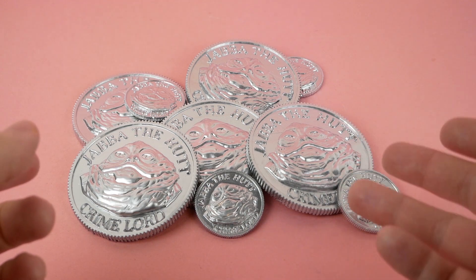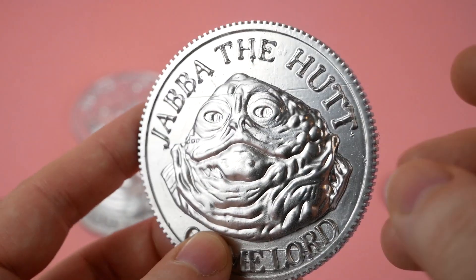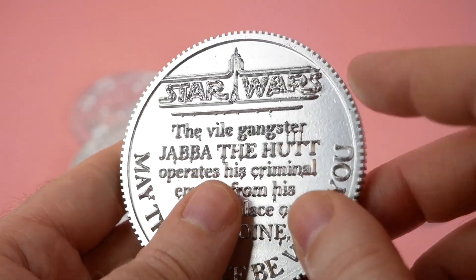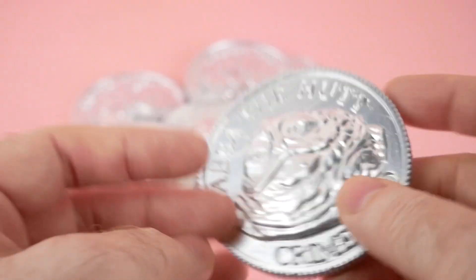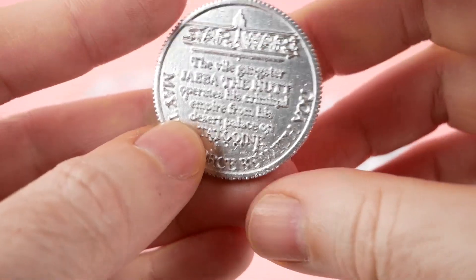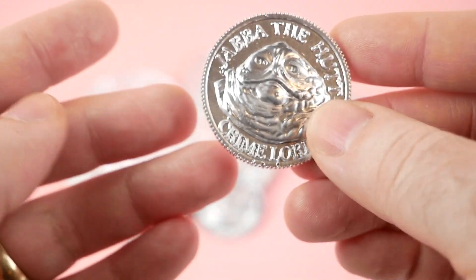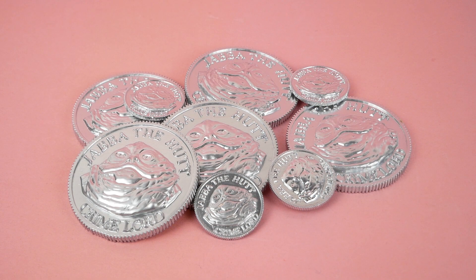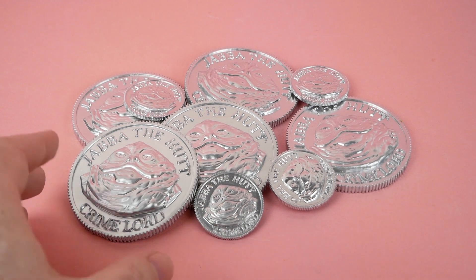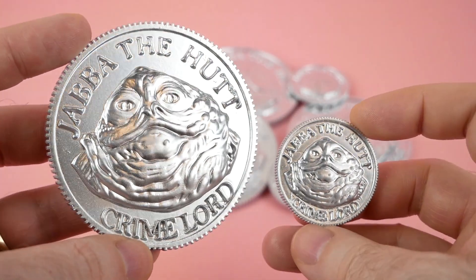These are all the coins that I finished — though I put that in quotation marks because I'm not totally satisfied with all of them. They all have minor defects of one kind or another that usually were revealed when I tried to paint them, like this line going across the top, and this one where I was still putting support material on the face to support the lettering — you can see scarring there when I tried to remove it. Luckily, I figured out that support wasn't necessary at all, which does improve the finish somewhat. In some sense, this was an easier project than I thought, because the initial coin design only took a couple of hours to mock up — and then I spent two or three days figuring out all the issues and getting that final five or ten percent of the design finished the way I liked it.